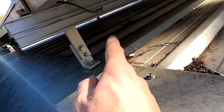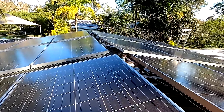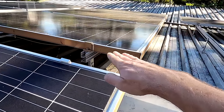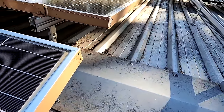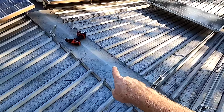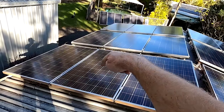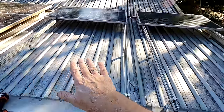So I will undo all these ones here - all my earth cabling for the existing solar panels - this all needs to go. I'll use ring lugs as well, so I need to lift the panel up a little bit and put these earth lugs in. Interestingly, I'm also allowed to use one cable now, starting from there, going through all the earth lugs, through all the panels, and then finally going down into the garage onto the main earth bar.